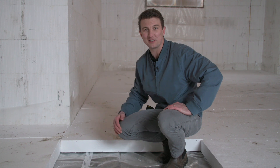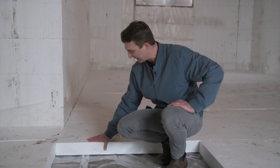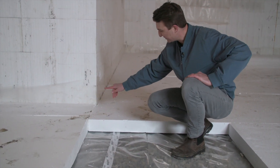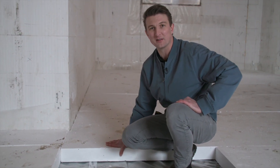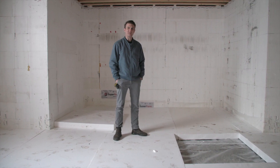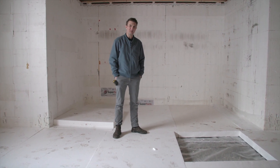It's not as though we're insulating up against a minus 16. So this is a 4 inch EPS, R16 value, and you can see that our concrete goes right on top of this. The concrete touches nothing but foam, so the basement slab just sits in a tub of foam and it's very well thermally broken that way.